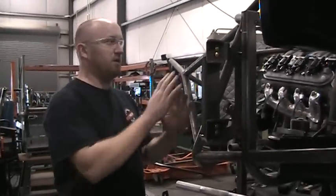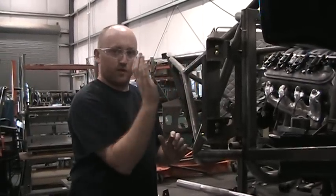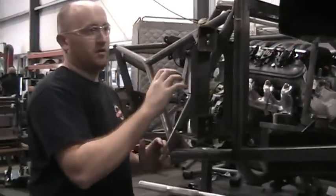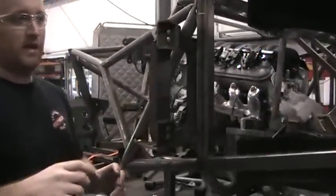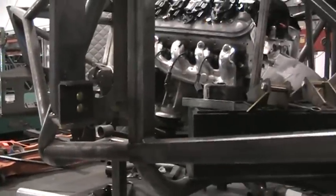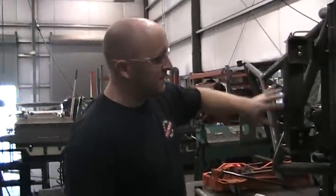And what that meant is if you had to adjust the door after you bolted it up, in or out, or if you had to kind of roll the door, the bottom edge in or the top edge in, you would have to take the door all the way off and then move the door about the frame inside the door. So what we've done is we've eliminated some of that complexity by adding the adjustment here so that you can access that while the door is still bolted up. So again, same basic design here.